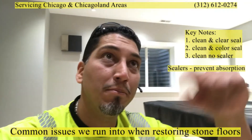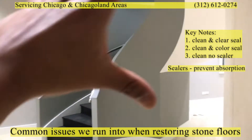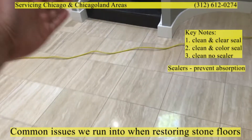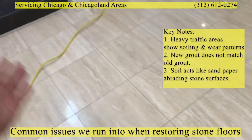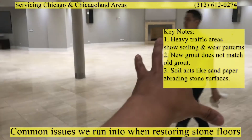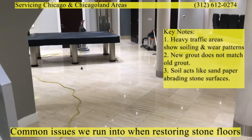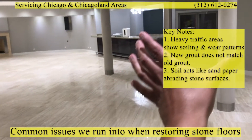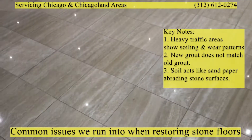Let's talk about traffic and how that affects a skim coated grout line. Everything boils down to the layout of the house. Here, people walk down the steps immediately onto this area, so this is one definite spot where the skim coat will start coming off quickly. From here you can go toward the bar, the family sitting area by the fireplace, the theater area, or the pool table — all of that creates traffic lanes.